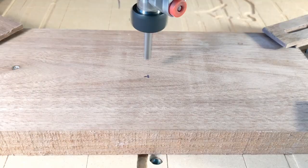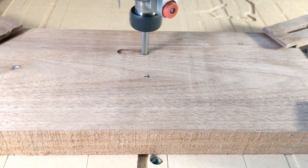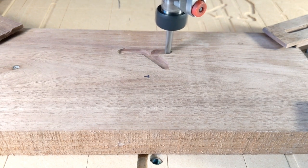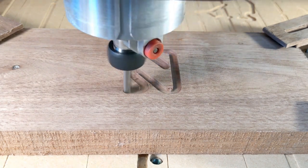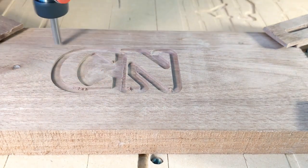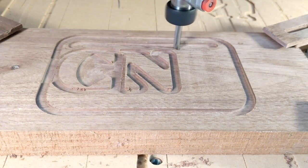So let's start right off at the beginning. What is a down cut bit? For all intents and purposes on a CNC router, a down cut bit is a side cutting end mill designed to profile out around items like this letter N and to clear out material, as you can see it's starting to do right now.